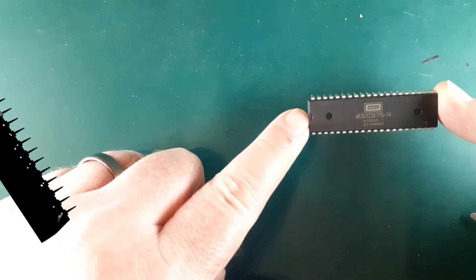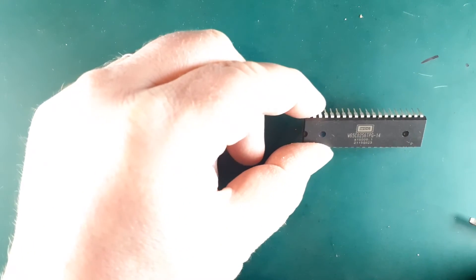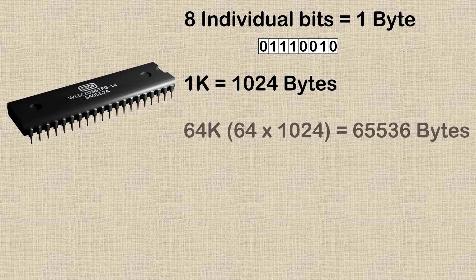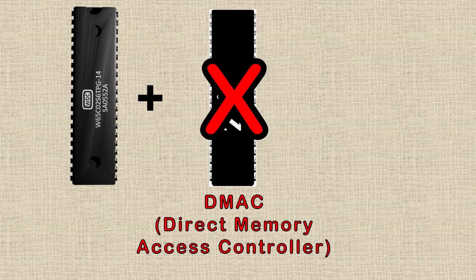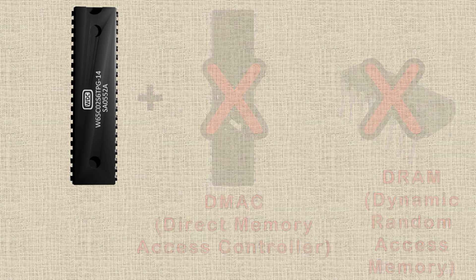Here's our naked 6502 in all its glory. Most of you watching will already know that along with the Z80, the 6502 dominated the home computer market in the late 70s and early to mid 80s. It was an 8-bit processor that could address 64K worth of memory. They had a small instruction set which made them kind of RISC-like and had a low interrupt latency. However, they did lack in other ways — in particular it was hard to interface them to chips that might want to access memory directly and to support dynamic RAM. These limitations could be worked around, but it was not as straightforward as other comparable processors.